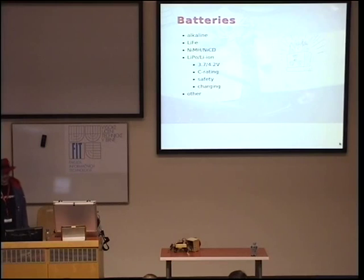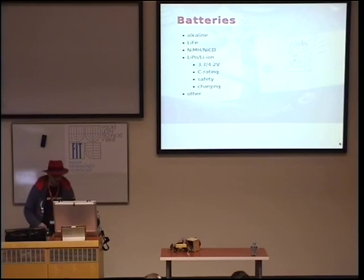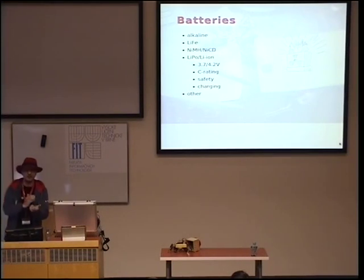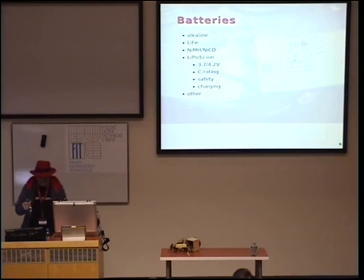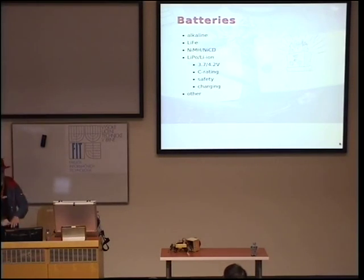So the heavier it is, the harder it is. The best option so far is the lithium polymer batteries. They sell them for hobby planes and helicopters and stuff like that. They're actually pretty nice. There is, however, a catch, because if you discharge them too much, you can throw them away because you won't be able to charge them back to their full capacity. If you overcharge them, or if you short-circuit them, or if you somehow drop them on the floor or puncture them, they will explode in flame and toxic fumes. And the flame is impossible to extinguish. So have a steel pot in reach of your hands to put it in and wait for it to stop burning.